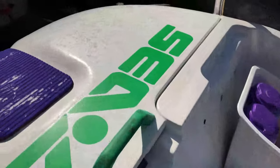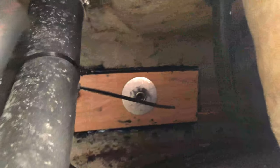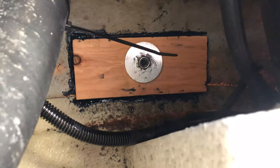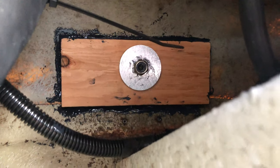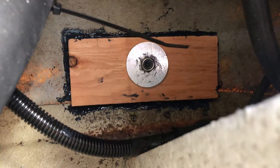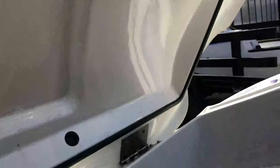For me, a lot of it was just where I could get to on the other side. We'll start on this side — look under here. I backed it up with some wood, about four inches wide, four inches tall, and maybe about ten inches long — I think it was like half-inch plywood, nice plywood. I went ahead and put some 3M 5200 marine sealant on it, so it should last a long time. This was the black stuff that took about seven days to cure. In the front I did the white stuff that cures in 24 hours. Put that on there, sucked it in real tight, then went around the edges with it as well.